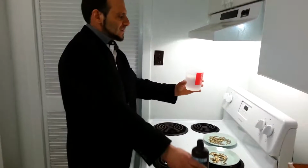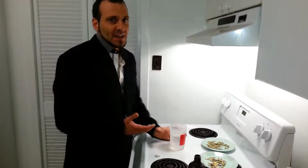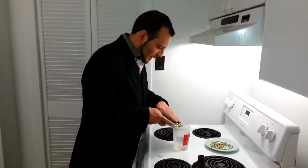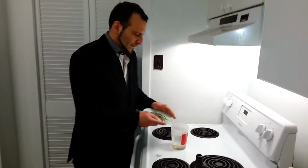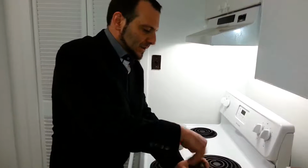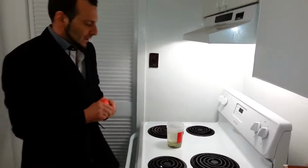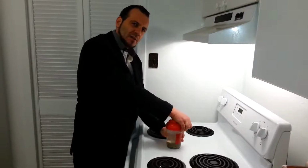See, as you can tell, as soon as I add that hydrogen peroxide, you see a little bit of fumes going. This is now an active solution to etch. Immediately take your fingers and put them in. Take the RAM and put it in. Close your hydrogen peroxide. Sorry about that. Put it away with your muriatic acid and cover it right away. You don't want the fumes to start going everywhere, or else it may start to smell.